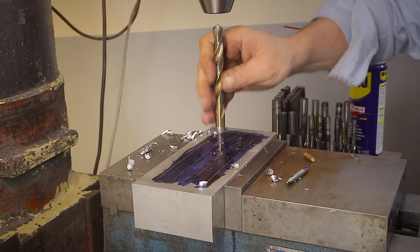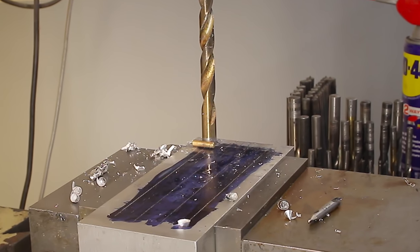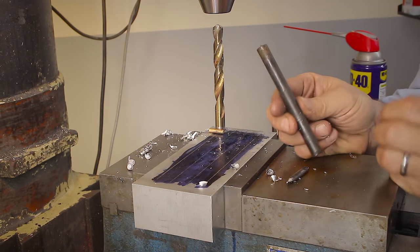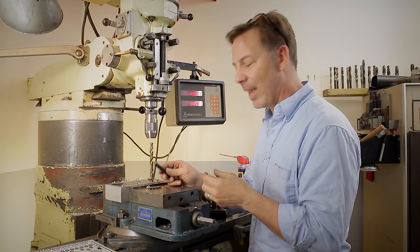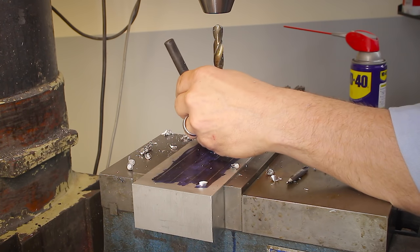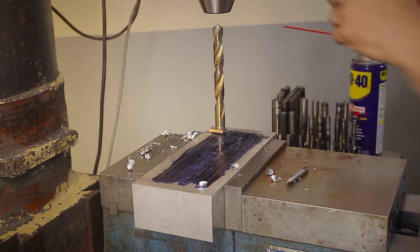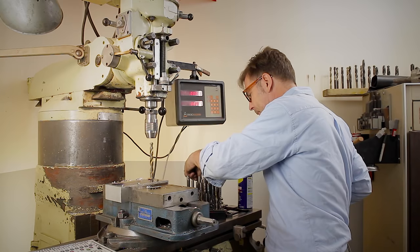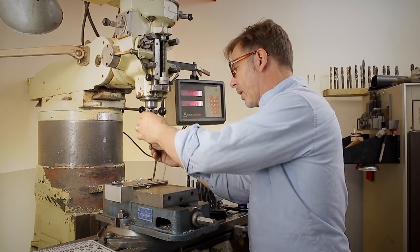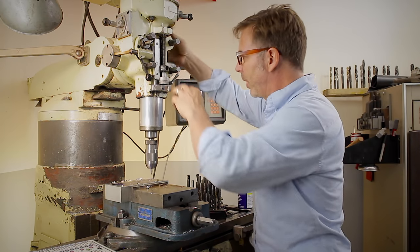What I'm going to do is take my drill bit, put it in upside down. Take a spacer, which can be any width that you would like, and I'm going to take a punch like this. Now, these are all set up to the same sizes as the drill bits. So the great thing is I just have to come in here, bump that up against my mark, take a hammer, set it. Now I'm set up to do the next hole. Bring this down.